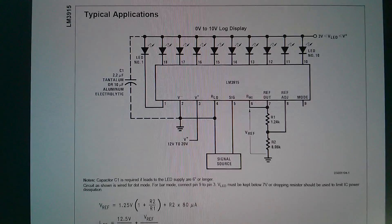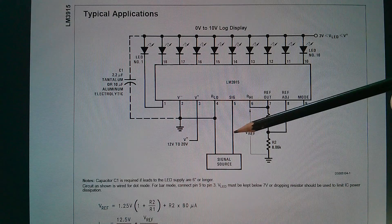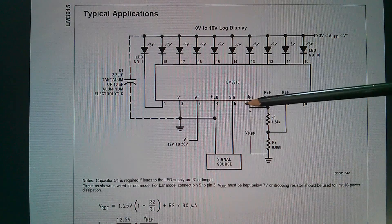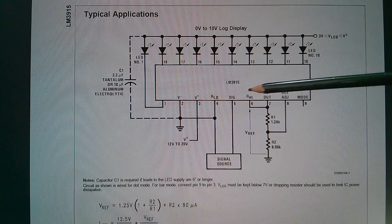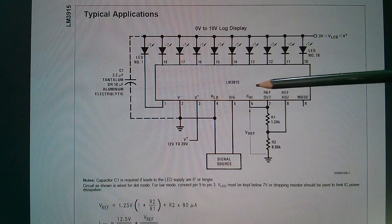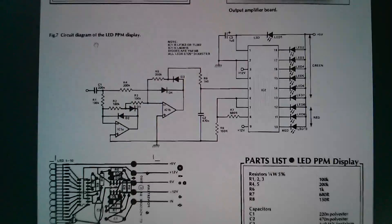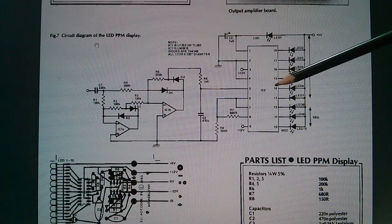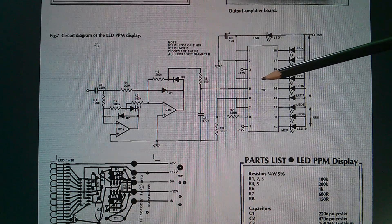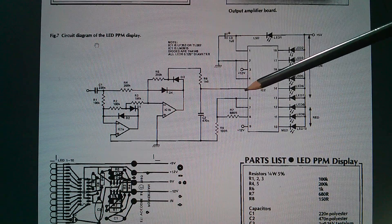Here's the application diagram — 10 LEDs across the top and the signal goes in here. This is for audio applications because it's logarithmic. The LM3914 was the linear one, which you could use for showing signal levels that were linear rather than log. In the ETI vocoder project, this is the LED bar graph — it uses the LM3915, which is why I thought I'd just buy a pre-built kit rather than trying to make it up on my own board.